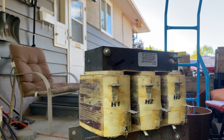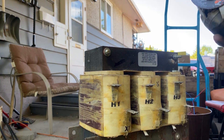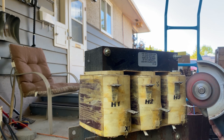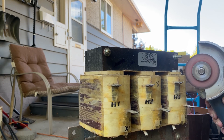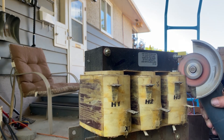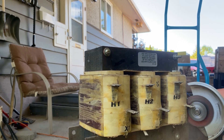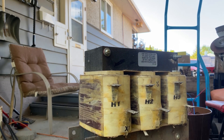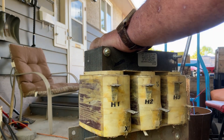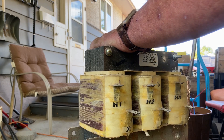The next step is cutting these coils — one incision with the grinder. It's an essential step. These coils were small enough I could cut them all the way through at one time. Now it's just a matter of prying them out with a nice large prying tool — I'm using this Snap-on mega screwdriver.